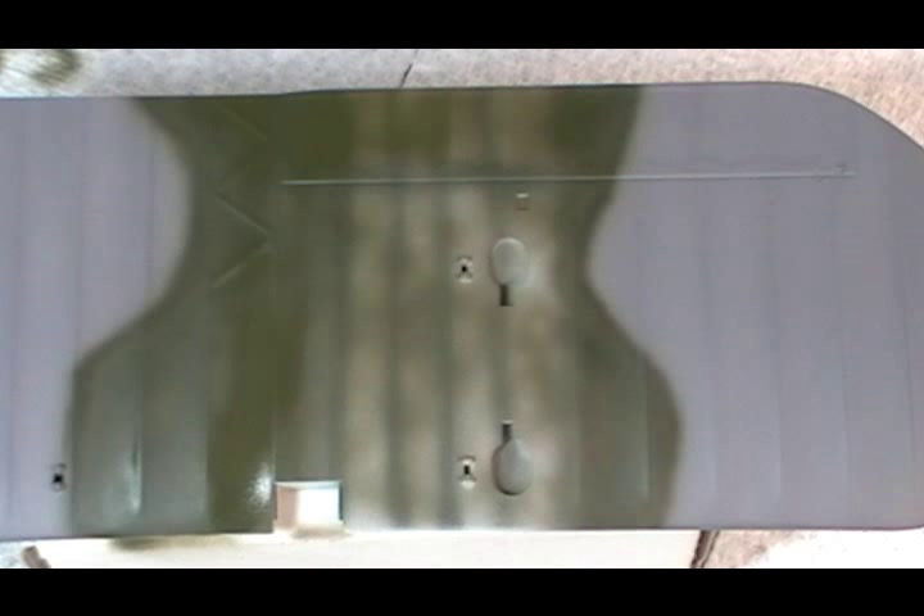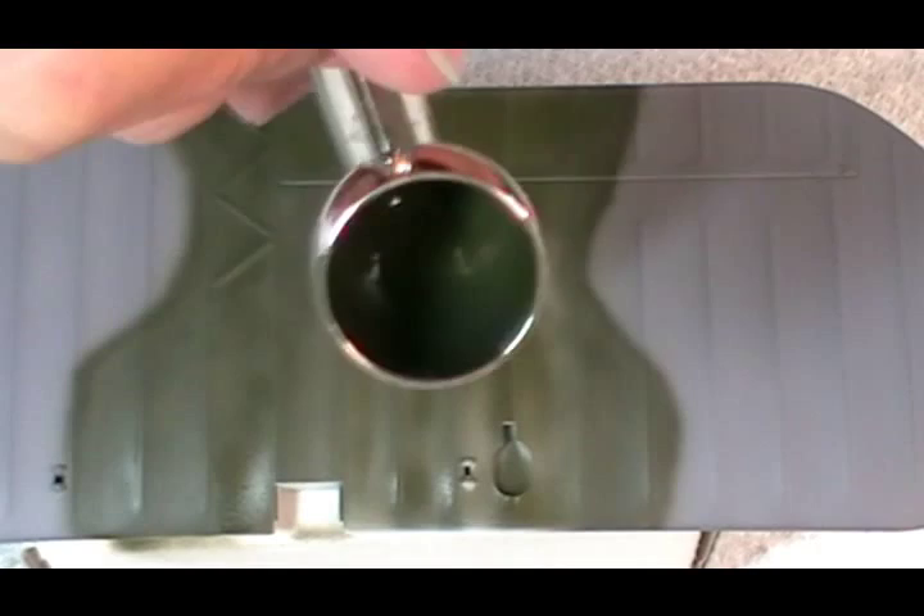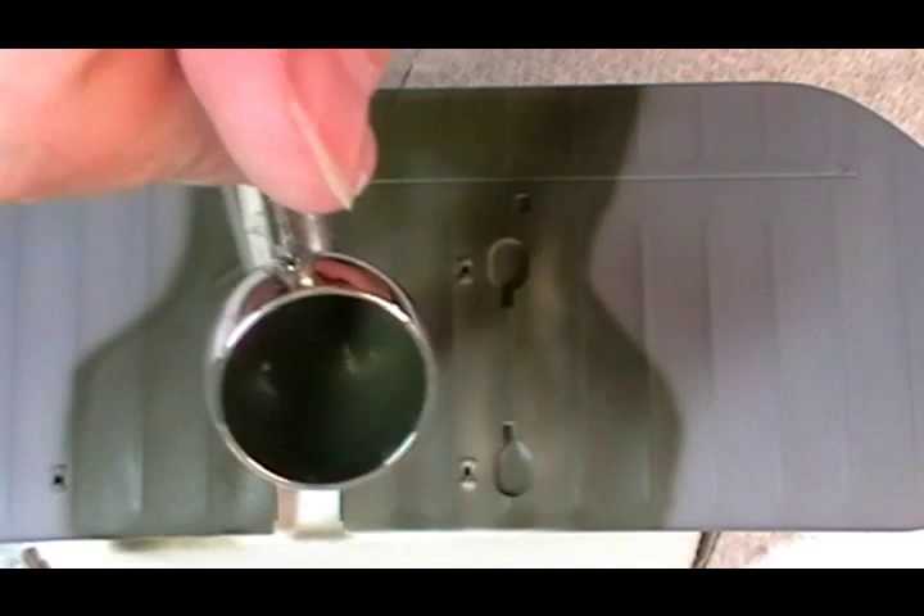So here we go — we're just going to build up this coat. Now we've got a bit more room we can do a little bit more paint, still not massively trying to cover this in one. We're just going to build it up slowly, a bit more paint going down now, pulling slowly back on the trigger. It's looking a little bit wet up here — we can just cut to air, needle all the way forward, just drying it down.